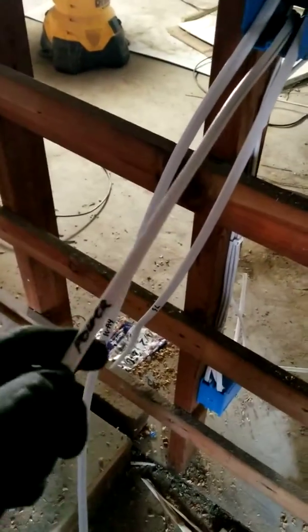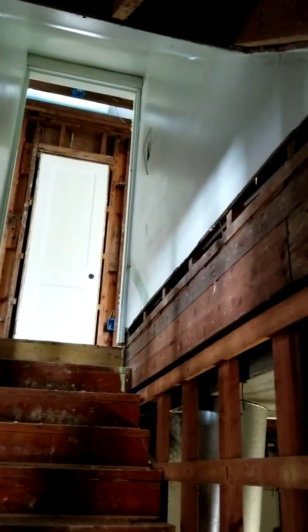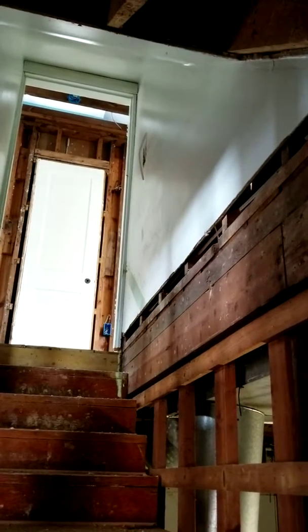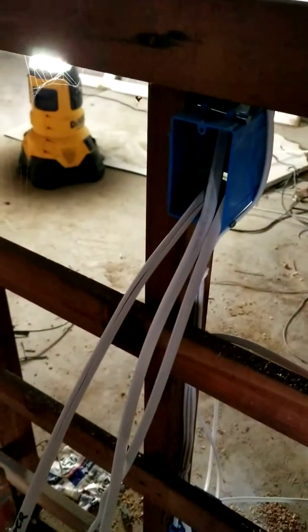This is the lesson for a three-way switch that has power, a switch leg, and a three-way wire in one box. The other side — the stairs side — only has one wire, 14/3, that's the end of the wire. I'm gonna show you how to wire this up so that you'll have power and a switch leg in one box.